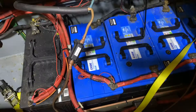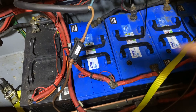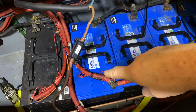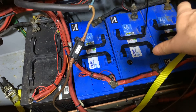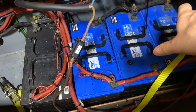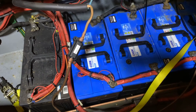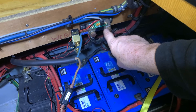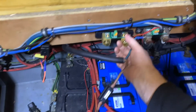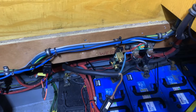Let me just show you what's going on here. This is the current setup. The existing battery bank comprises four 115 amp hour lead acids. The intention is to keep the first lead acid, remove the other three and replace them with two 200 amp hour lithium batteries through the new shunts. I've now got two more shunts which I'm going to add in — one for the lithium bank, one for the lead acid bank, and then at some point in time we need to connect them together.